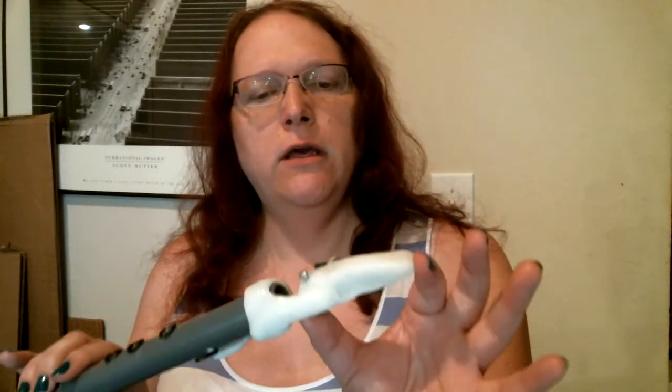This is what we currently have right now. One thing I've learned is that here in the mouthpiece, we want to keep the volume pretty small so that you don't have to pressurize up a large volume when you breathe. That's why this is fairly small with very small areas inside that we have to breathe into. Also, the small hole down here for letting the water out is very important.